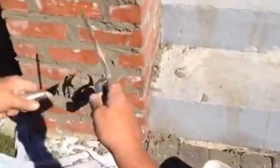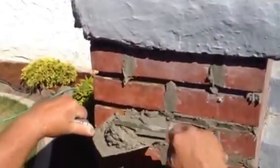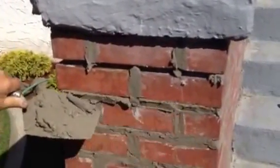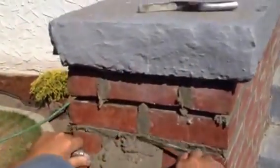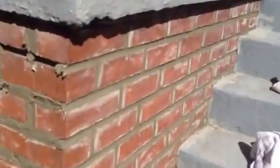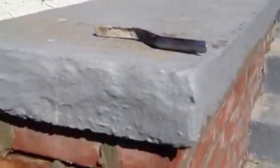I take a little mortar like that and just fill that in, and then I strike it off smooth. You can basically leave it like that if you want, or you can tool it like over here, where we've tooled that side with a round jointer. We'll do that a little later too, but first I'm going to finish this off.